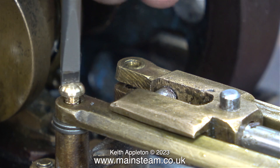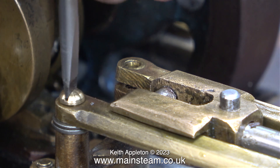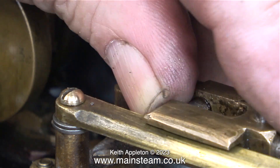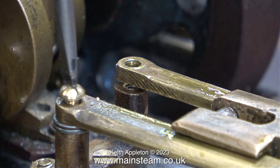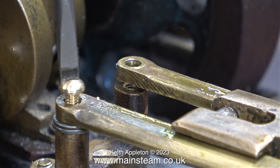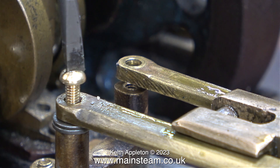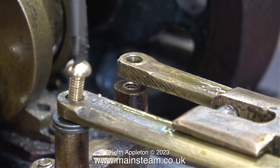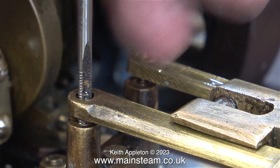This is a way of levelling up the crosshead guide bars. A couple of random washers really does look awful, so I'm using the washers to find out the thickness I need, then I'm going to duplicate that thickness with brass washers turned on the lathe. I'm removing the bolt to withdraw the washers; the 5BA bolt felt quite tight in the hole, so I'm re-threading it using a 5BA tap.